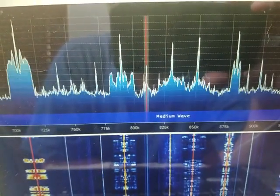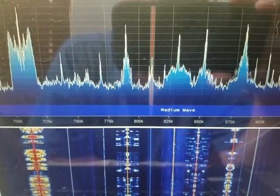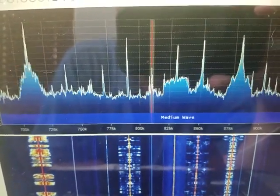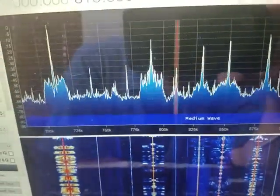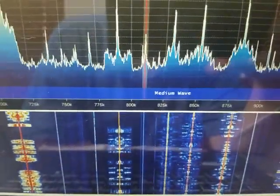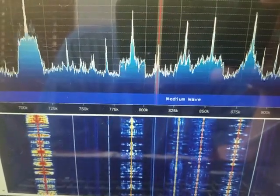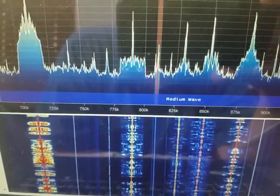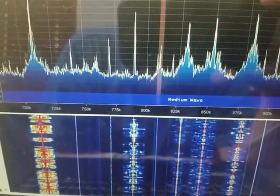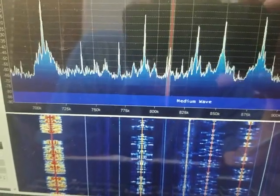Of course, the antenna comes into play as well. For this test today, I was using a dipole cut for 40 meters. So that's an amateur radio antenna, which is a 40-meter dipole. Also, one more thing to notice here. We are using two different pieces of software for SDRPlay and the RTL dongle. And because these are software-defined receivers, this could make a heck of a difference from one piece of software to another. I wish I could have used the same software with similar settings, but I wasn't able to. The RTL dongle, currently the sampling that it uses, I can only get it to work on SDR Sharp. Maybe that's going to change in the future, and it can be accommodated by the other pieces of software as well. The other ones will tune it, however, you will not get much of a signal out of that.